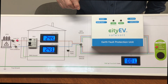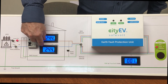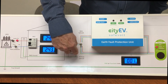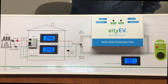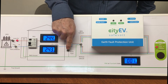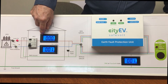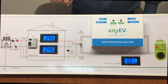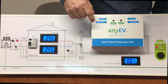We are measuring the live-to-neutral voltage and live-to-PME-earth voltage — currently around 240 volts — and also the potential difference between the PME earth in the installation and true ground potential, currently sitting at just one volt. To verify the master RCD is operating: introducing an earth fault trips the RCD, dropping the line-to-neutral voltage to zero and powering down the charge point. After resetting the RCD, we have 240 volts incoming mains and zero volts between PME earth and true earth.